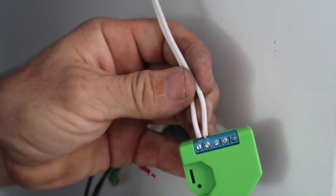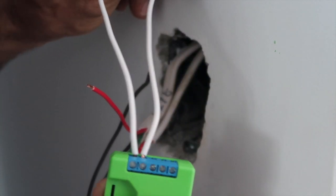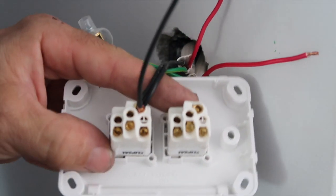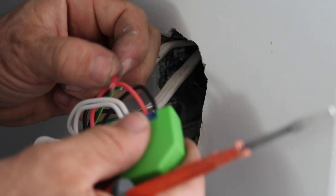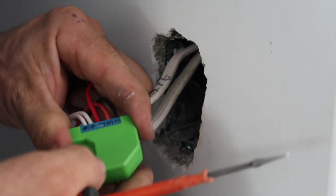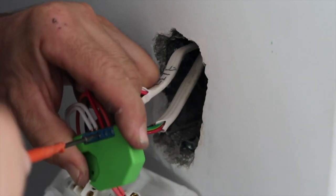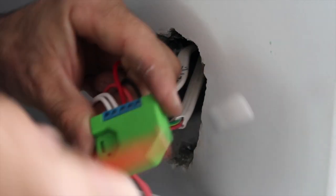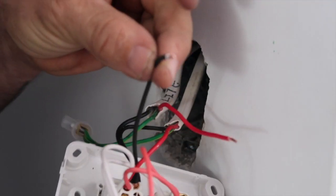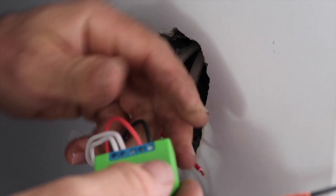In addition to that, we've got our two switch wires. One goes from I1 and one from I2 to each of the switches to operate our dimmer. And finally we have our output that runs off to our light. It's important that you correctly identify the correct locations for neutral especially — if you get that in the wrong place you can cause trouble, damage your dimmer, and short something out.